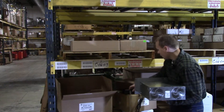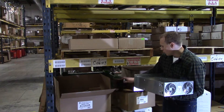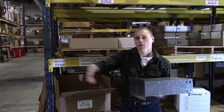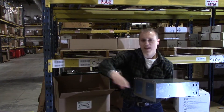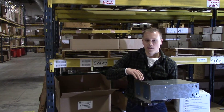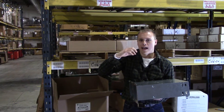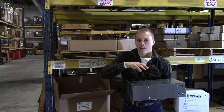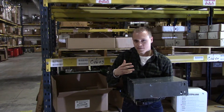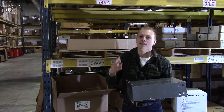With these fans, they can be slid in however you want and changed seasonally or whenever you choose, so that either both fans are blowing out, both fans are pulling air in, or you can have one fan blowing out and one fan blowing in for even air exchange. You're bringing in fresh outdoor air and diluting the heavy radon gas with that fresh outdoor air, lowering your levels. You can change those things seasonally or just leave them running constantly.